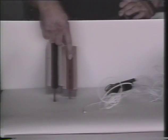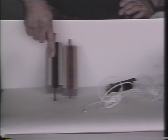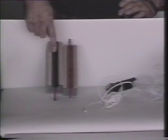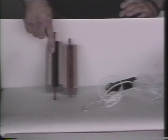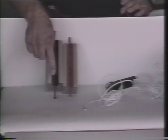The Model 530 utilizes 3 explosive-filled cords, whereas the Model 531 utilizes a plastic explosive that is extruded from a hydraulic press under pressure in the form of a V. It makes a much more efficient cutting charge.